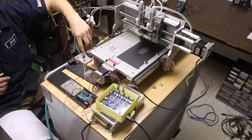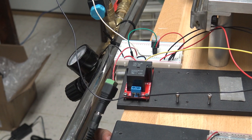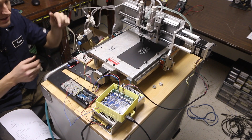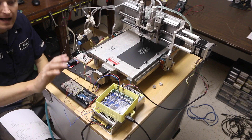The beefcake relay is what controls the solenoid — link below for the parts. The solenoid then lowers the pneumatic cylinders. The only other thing we've got is a 7805 regulator because there's a wall wart coming in providing a 12V signal to toggle and power the beefcake and the solenoid, and then I step that 12V down to 5V to power the Arduino. The TinyG is isolated from all of that.